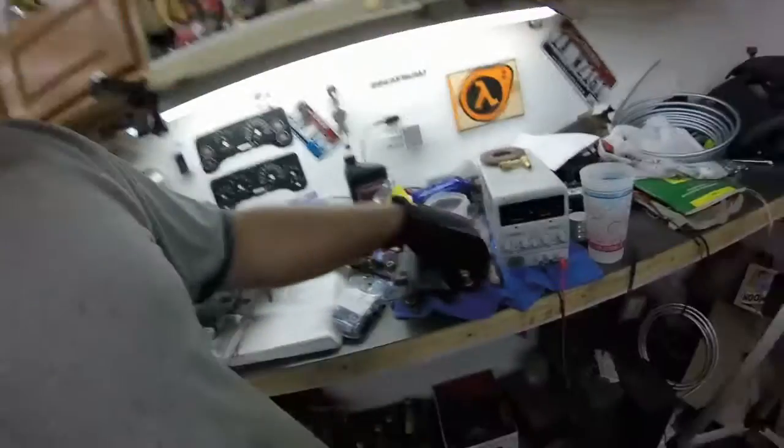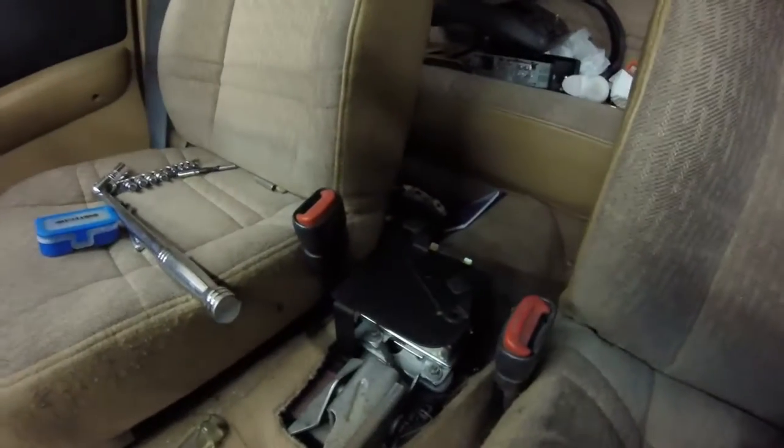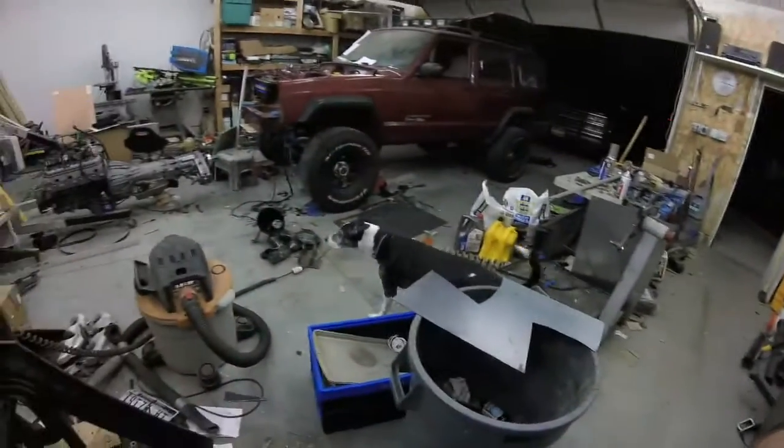I got new JCR nut strips to put in, so those are nice. And I ordered the JCR center console bracket, and I think I'm going to send them an email about this, because there it is right there. Hopefully you can see that. It's not too dark. It's screwed down and it's mounted, but the thing wasn't even close to fitting. I don't know if, because the airbag module is underneath that thing, that varies a lot, like they just punched holes at the factory and mounted those wherever. But that JCR mount was probably half an inch off. The holes were half an inch off from fitting. Yeah, it was way off.